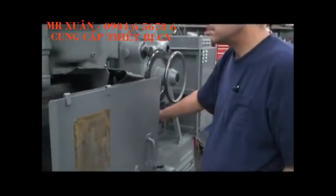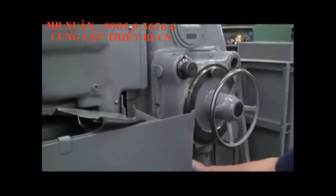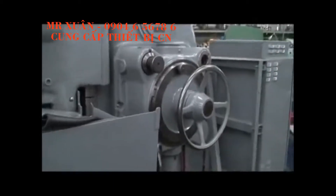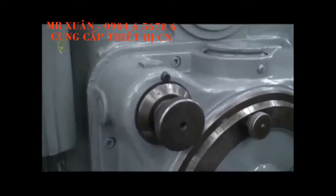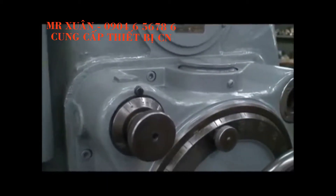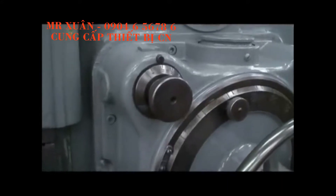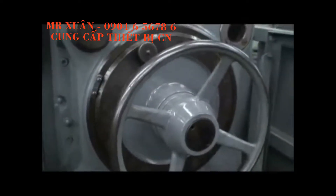We're doing power elevating to lower the head. We can go into a pick feed mode — automatic feed mode — which is set and regulated by this dial here. It can feed from four thousandths to seventy-six thousandths inches per minute. This little knob here sets the stop point, comes down to this point, and will shut off automatically.